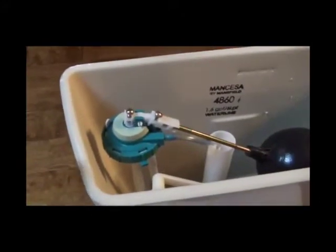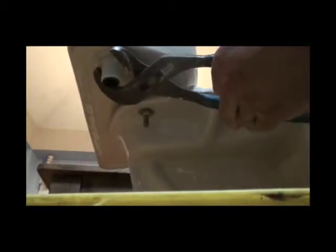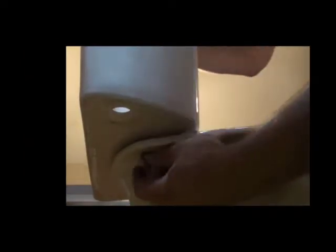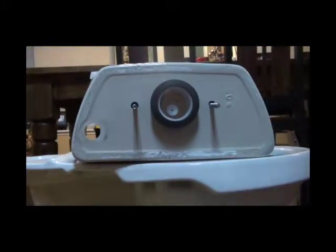Make sure you've got a good shutoff valve, and now you're going to disconnect your fill valve — undo your supply line. Notice the plastic nut here; I have not had problems with plastic nuts on the Brasscraft brand. Your fill valve is attached with a retaining nut — undo this, and it can be tough. Sometimes if the toilet's older, these nuts will actually break off on the ends and it's very difficult to get them. Once you get that nut off, pull your fill valve out, but have a bucket underneath because there's going to be water coming out of the tank. Flush to get as much out as you can. Undo the nuts on the bottom — I use a half-inch wrench and undo the nut on the right first so I can tilt the tank and get the water out. Set your tank up on your toilet — be careful, this is all breakable; porcelain is very sharp.